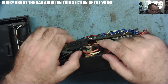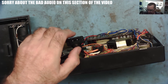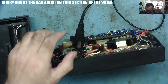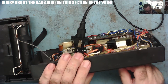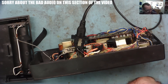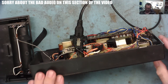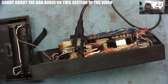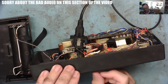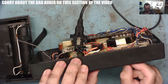Let's have another look. We'll try it off the main power again, and then we can also try off the battery - well I haven't any batteries, but I'll put my bench power supply on it, which I know is a nice smooth voltage supply. I was wondering if the humming or buzzing noise was coming from bad capacitors on the mains input. Let's turn it off and try it. Turning the tone control up... it makes strange noises.